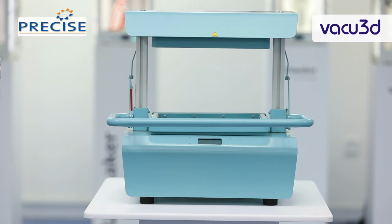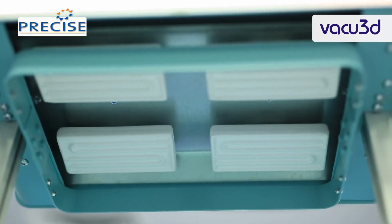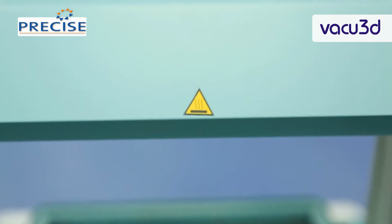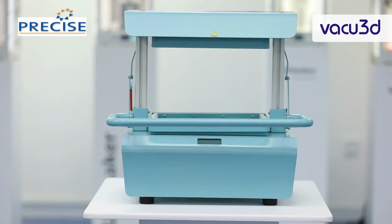When using Vacu3D, always follow basic safety precautions and read the user manual. In the upper housing of the Vacu3D, there are radiators which emit a significant amount of heat during operation. Be careful. Do not place your hands under these radiators. Do not touch the upper housing as well.